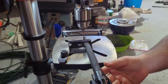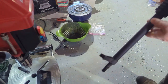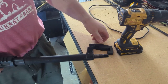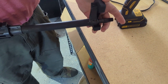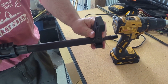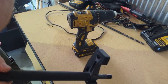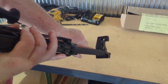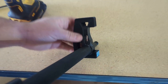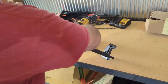All right. Now ream it. This is your reamer stop down here. When the reamer gets down in here and bottoms out, then you'll know that you're good and ready for test fitting. This just helps you get started a little faster.